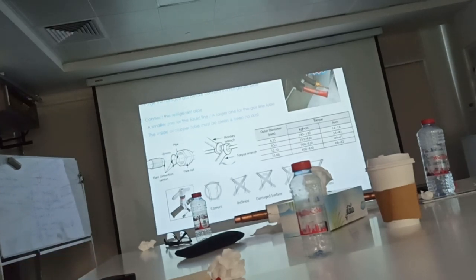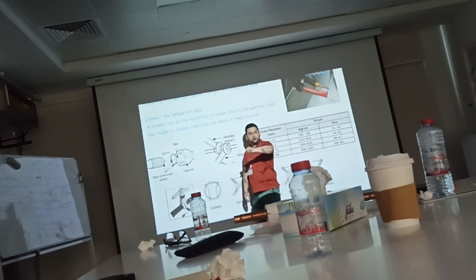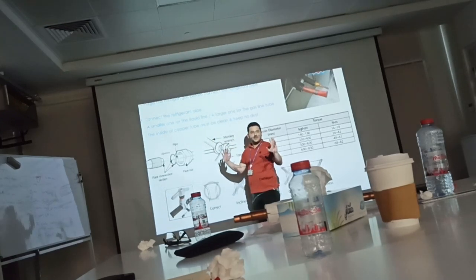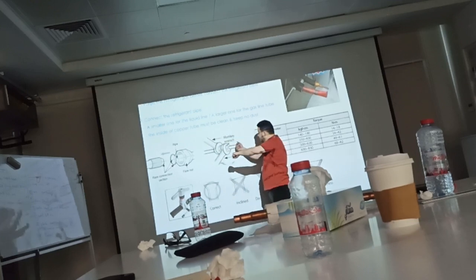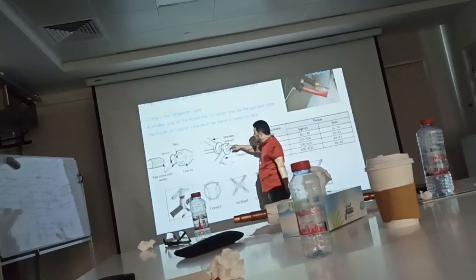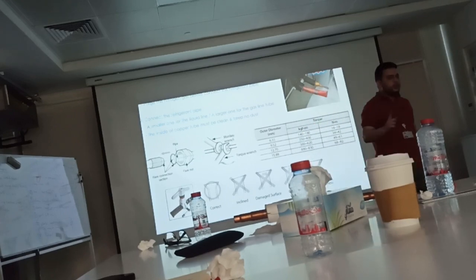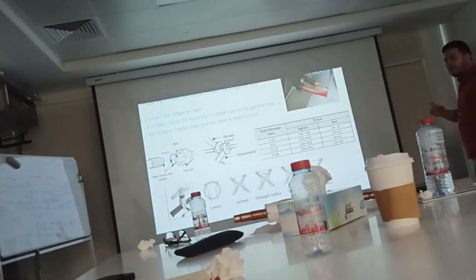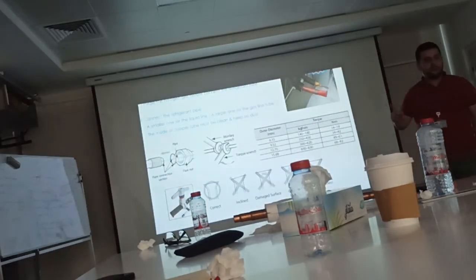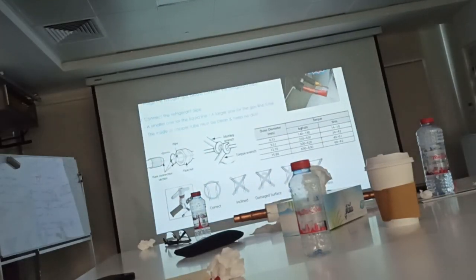Okay. You need to use this normal wrench, this fixed one, not adjustable. Or you need to use adjustable as you like. But one side should be fastened with acceptable, adjustable or normal wrench, and the flaring itself should be done by torque wrench. And without Teflon tape. Teflon tape is not allowed to be used on the flaring. Okay? Flaring should be done directly without any assistance of any other material. Okay?